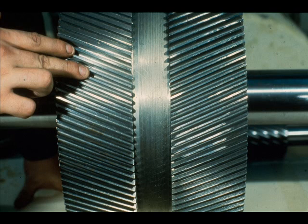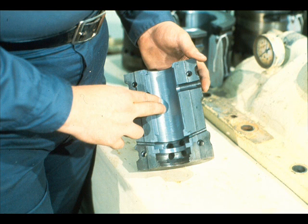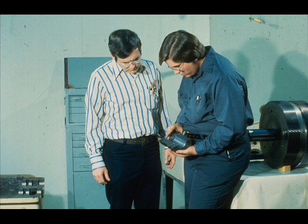The gear teeth of both the gear wheel and the pinion must be carefully inspected for wear, pitting, spalling, breakage, or other signs of trouble. Examine the babbitt bearing liner surfaces of each bearing for excess wear, flaking, or wiping. And if troubles are found of this nature, let your supervisor know about it.